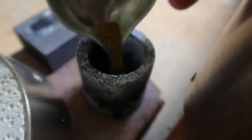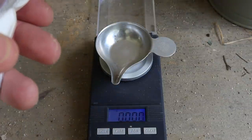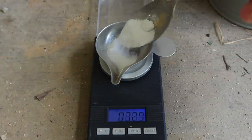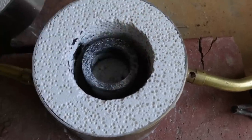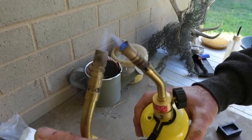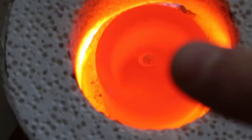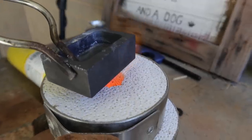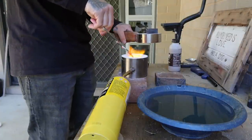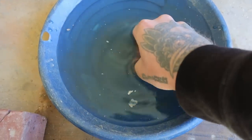Here we go - that's the last time we're going to see that as flakes. When it comes to flux measurements you want about equal amounts. I have about four grams of gold so we're going to use four grams of flux. Shake it all about and get it nice and mixed up, then into our tiny little benchtop furnace. Normally you wouldn't take the lid off, but I just wanted to show you guys the gold - that little glowing thing right there is the gold coming together.